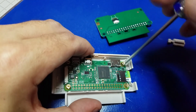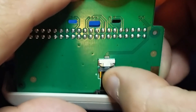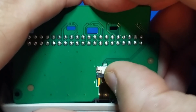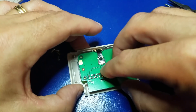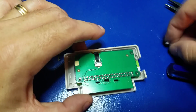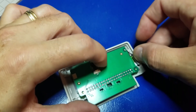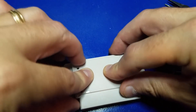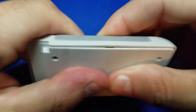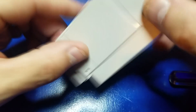You want to make sure that little black connector there is down, then push the little ribbon cable up in there and push up on the little black piece to lock it into place. If you have any troubles with your buttons, most likely this is the reason — so make sure that connector's in there fairly snug. Now we'll put the cover back on for the micro SD slot. The size card you use depends on what you want — you can use anywhere from an eight gigabyte on up. I'm actually installing 128 gig in this one. We'll go over the software installation in just a moment. The cartridge looks pretty cool.